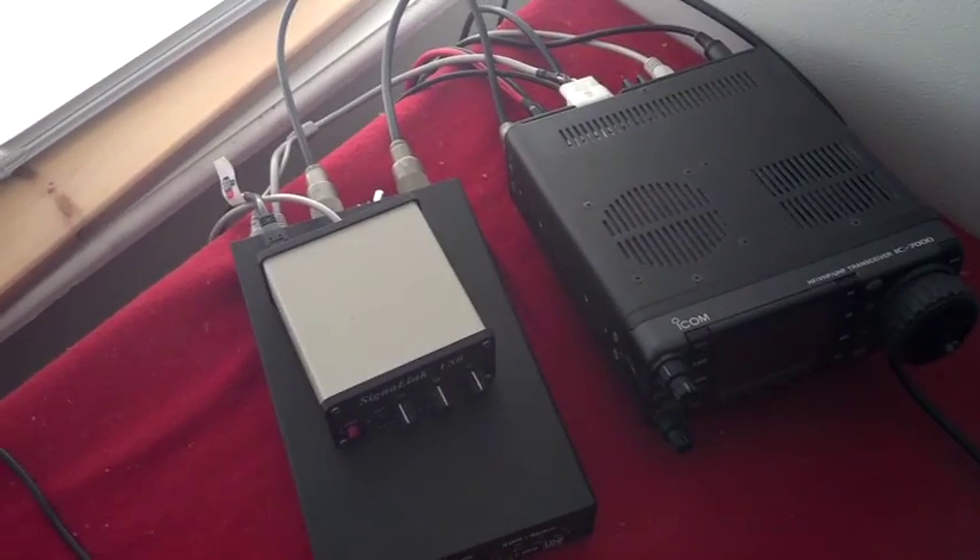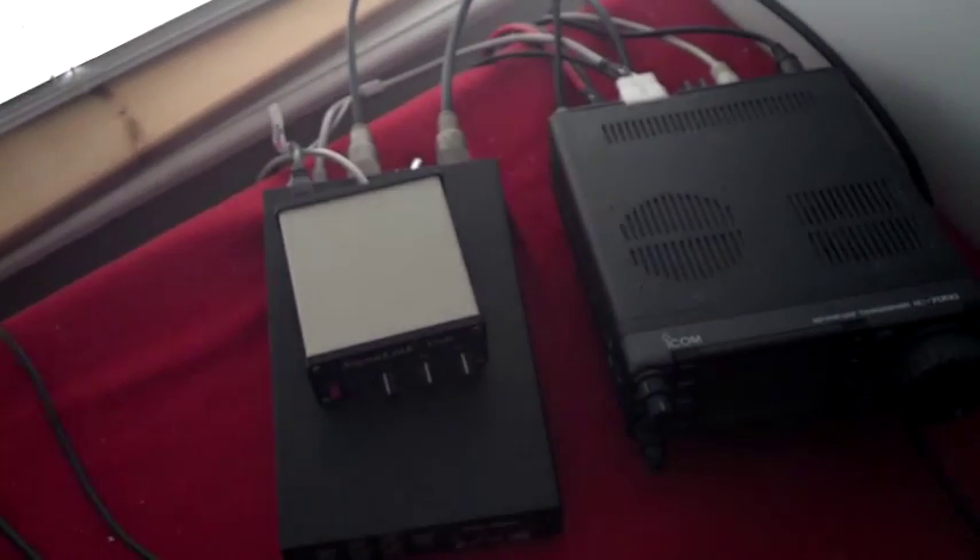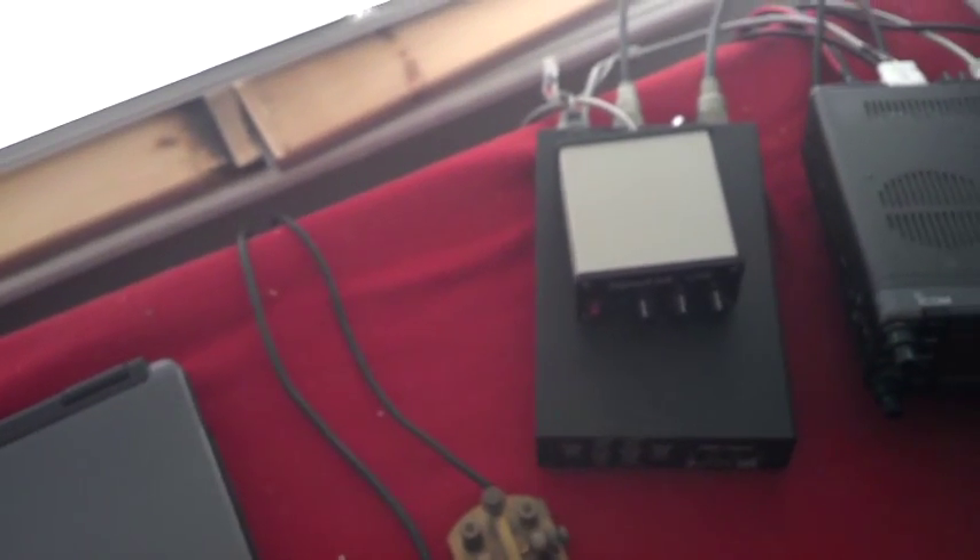So as you can see, there's a lot of things that do RF in the house. A simple, old, cheap AM radio — probably cheaper the better — works really well as a cheap RF detector. I know that I can't have the compact fluorescent lights on when doing ham radio stuff. I'm just going to have to get a bunch of ferrite cores and start protecting things. Friday's coming and that's payday, so you guys might want to invest in toroids and stuff like that because I'm going to make a huge buy.